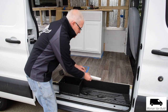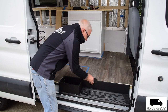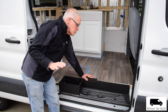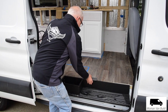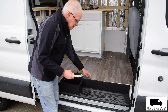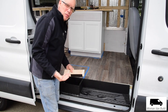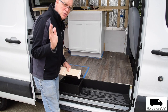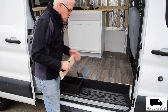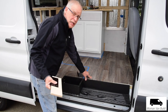I can almost get by with this trim but it just barely gets over on the linoleum, so I'm going to be much more satisfied with this wider piece. We're going to use minimal nails or screws. I did a test yesterday with liquid nails on half-inch plywood — you could not get it off. But it's a little too cold; it's supposed to be 40 degrees and up for almost any adhesive. We may use liquid nails or JB Weld — haven't decided yet, but I'll wait a few days when it's almost 50 and sunny.